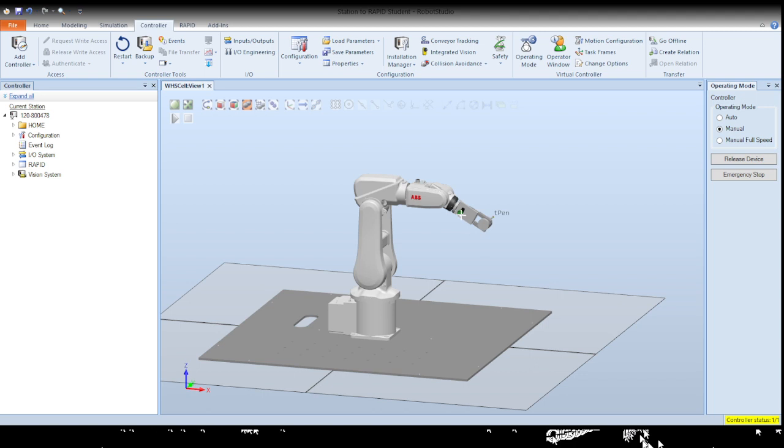You might have an existing program like I do. I have some move absolute J, a move J, you might have some move L's. We're going to start over. So go to your task and program bar right here, click it, go down to file, and click new program. But don't save. Make sure that SMT is highlighted. You may also want to make sure that this is enabled.